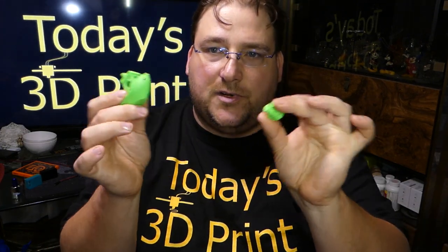Just let them dangle - one up on the arm and one on the back on the bed - and plug them directly in. You unplug your wire going to the stepper, plug this wire in, then plug this wire into this, and the wire that was going to your stepper into this. Done - your TL smoothers are installed. These results are fantastic. I love these prints, and this printer is now worth going further into. I've already ordered fans so I can quiet the Tornado down.